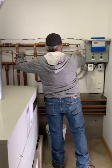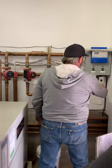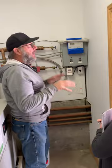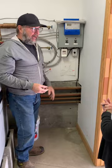So these two run together, and this one runs alone. I would assume this one is zone one, and this one is zone two. Mm-hmm. And you can say, hey, I want to turn on zone two for 6 hours. Oops. Then you could. It just runs on that timer. Manually, and then when the timer's done, it turns off. But if your controls were working, your sensors are working, everything's doing its job, automatic is the way to go.